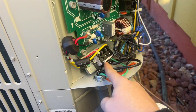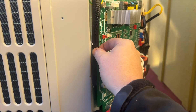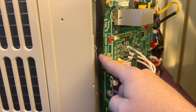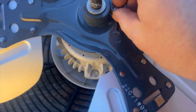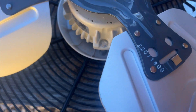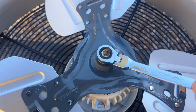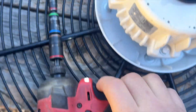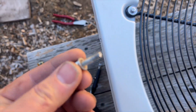Got her all wired in, plugged everything back in, got the high voltage wired in. The only thing we need now is our outdoor fan. We'll change up that motor. I went ahead and loosen this — that's a half inch — and this nut goes clockwise. There are four of these five-sixteenth screws all around, screwed into the top nuts. It looks like you can unscrew them without grabbing the bottom. But when you're taking the motor off — take these top screws off first — otherwise if you do what I did, you're going to snap the screw.